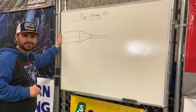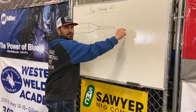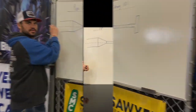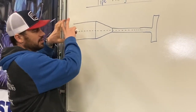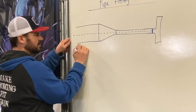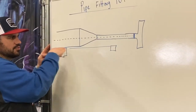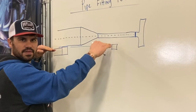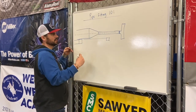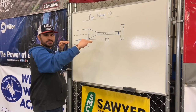The devil is in the details on these reducers. Let's say that's a 4x2 reducer. The center line — there is no change. So if we were to come out here and have a flange on there, the center line is not going to change. One thing to be really aware of when you're putting together concentric reducers is your hanger heights. If you take a laser and shoot a hanger in to support this pipe, then swing over and set another hanger, that pipe's not going to sit flat. So on concentric reducers, your hangers are going to change — your pipe supports. That's a detail you need to be aware of: when there's a reducer in there, the bottom of the pipe is not going to match up.